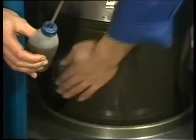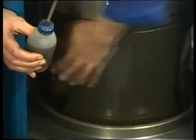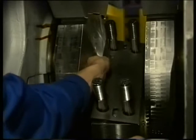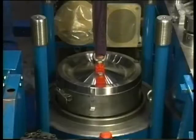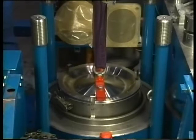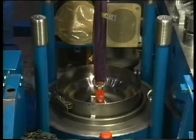Now apply a layer of clean lube oil to the piston skirt. Fit the intermediate plate to the connecting big end bearing caps. Make sure that the plate is clean and undamaged when it is fitted. Next, continue lowering the piston. Check that the piston rings slide smoothly into the liner.